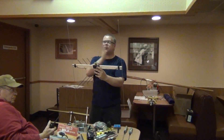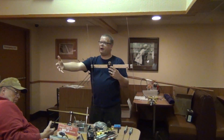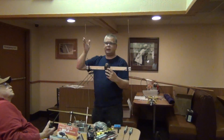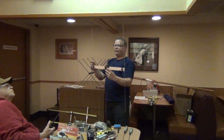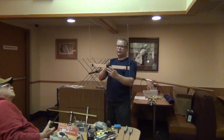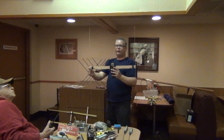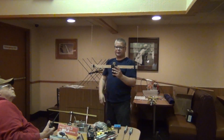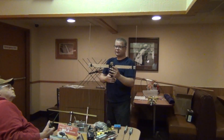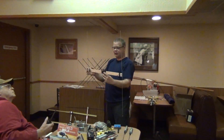The principle is: by switching between these two antennas, it looks at the phase of the RF wave coming into the signal. If the antennas happen to be equidistant from the transmitter, you're not going to get any change switching from one location to the other. However, if they're at different distances from the transmitter, switching back and forth will impart that 500 hertz tone onto the FM signal, and you'll actually pick it up on the FM receiver.